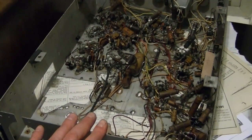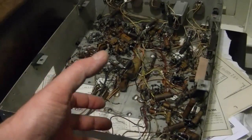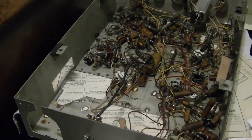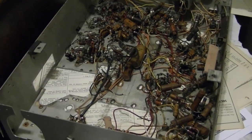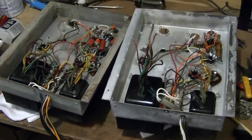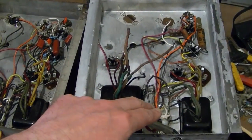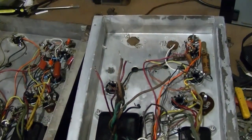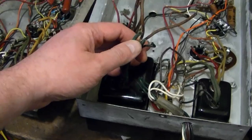It's a nice luxury to have a spare chassis in case I need controls or other parts. The one I'm actually restoring is one I showed briefly before when I was hunting for that power resistor inside the high voltage cage. It was on the back porch. Just finished remounting both power transformers, the choke, and the audio output transformer on the power chassis, and now I'm wiring them in — just finished the smaller transformer and now I've got the big one to do.